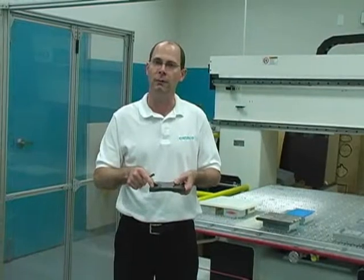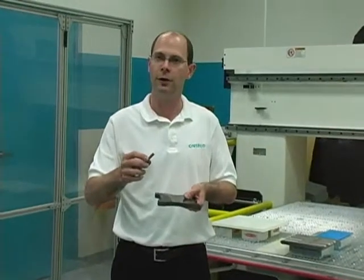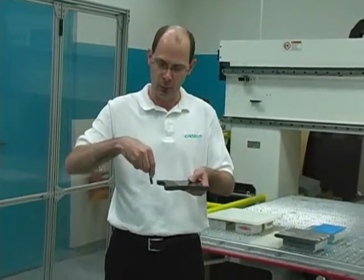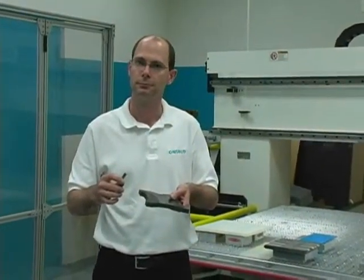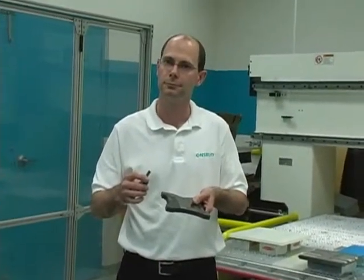In non-critical applications this finish is acceptable, but there are some parts where you need a nice smooth edge. That's where you have to come back with an alternative finishing tool and take a second cut — a two-tool process, rough and then finish. That is the reason why we developed the SERF Finisher. We have the finishing wing here, which is slightly higher than the two roughing wings. That way, in one single pass, you'll get a nice smooth edge. So you have two roughing flutes — wings, cutting edges — and then a finishing edge that comes back and makes that nice smooth edge.